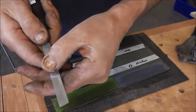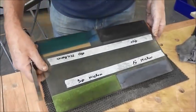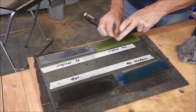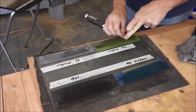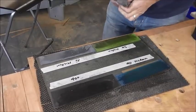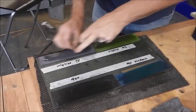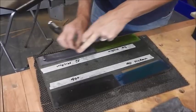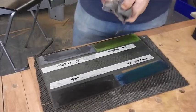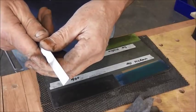I'm almost getting a mirror finish now. As I said before, we did the flattening on the 80 grit - all that we're doing now is really polishing, so that we get a nice good edge when we come to hone the thing. And finally on the 15 micron. Now if I wanted I could go on to the very fine stone - I've got a 10,000 grit stone which will give you a nice polished edge. But I think we're okay there - that's looking quite nice, I can see my reflection there.